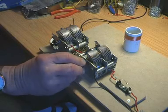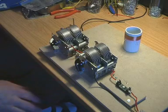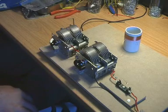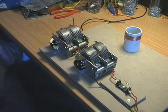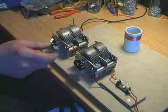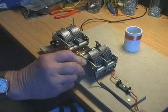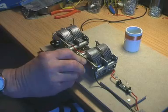There's our football station again. Now we've got another station almost in the clear. Of course, the trouble is making simple crystal sets on a Saturday afternoon when there's a lot of football on — it means it's hard to tell one station from another, or at least it is for me. Let's decrease the coupling to its minimum and begin again. You'll notice the tuning is now sharper; this first football station is now in quite a narrow area of this variable capacitor.